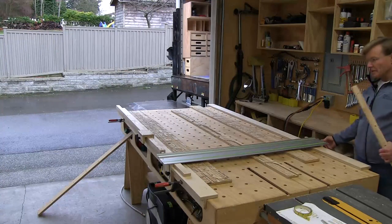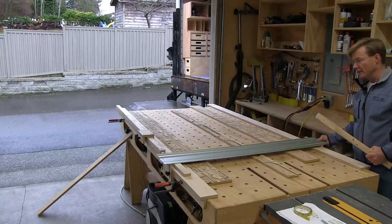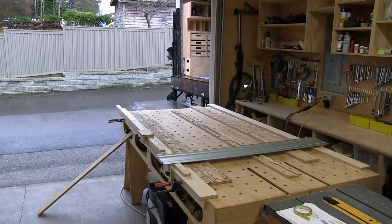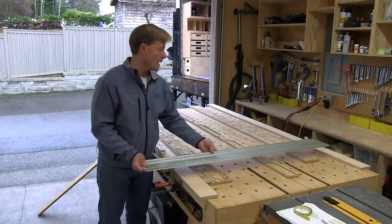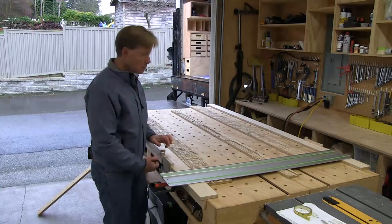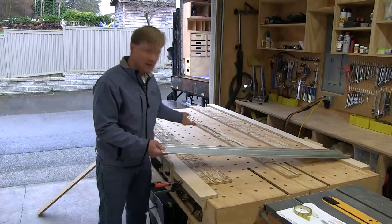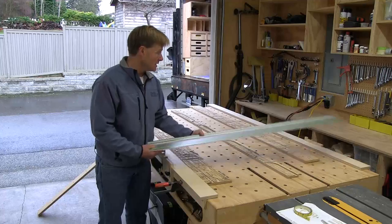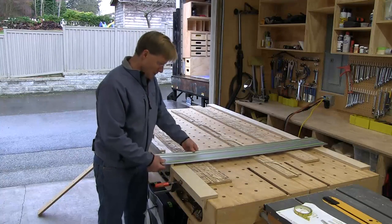Once that's done, the scraps can come out. You can adjust it for a quarter inch, half inch, inch and an eighth, or whatever you're cutting. I also made it so the track can just be pulled right off, so you don't have any nuts or bolts to pull loose. And when you're loading plywood instead of sliding it in underneath, you can still do that if that's quicker — but at least you can remove the track quickly without having to go over and undo some bolts.